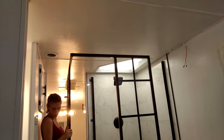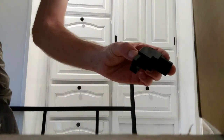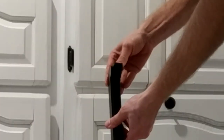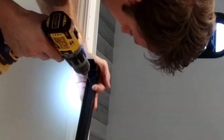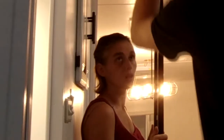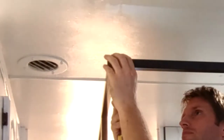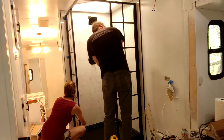Next we need to piece our door profiles together. These are the stationary pieces of the door that the sliding door is attached to. There is a corner piece which will overlap the two door profiles — slip it on over the end piece and install the appropriate screw to hold it in place. This may require a little pre-drilling but don't use a drill bit wider than your screw. You'll need to do the same at the top of it as well, installing another corner piece. Take the two door profile pieces and set them up near the shower, put them together with that corner piece connecting them, then apply two more screws to the other side of that corner piece. If you measured everything correctly it should slip right in with a little flexibility to the wall profile pieces.